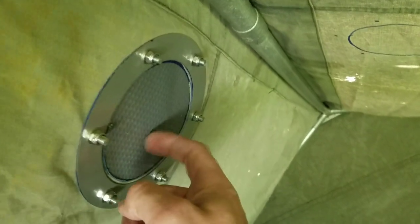Looking at it from the inside, it's pretty low profile — there are just a few little bits of bolts sticking out, and that won't stop it being folded up. No light coming in from around the edge, so I think that's a pretty good job done. Tune in again and we'll put on the chimney bottom, light the fire, and see how that goes. In hindsight I might swap these out for wing nuts, because this was definitely a two-man job to install — someone on the outside holding the spanner whilst I used the ratchet to tighten the lock nuts. Apart from that, stay tuned.